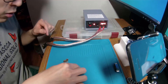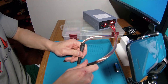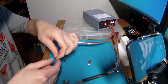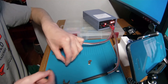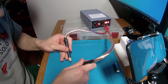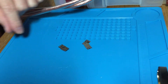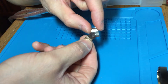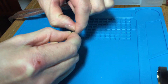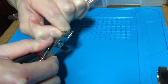So, nickel on nickel, starting at level 3. You can see it made marks in the back but didn't blow through anywhere. Let's see if we can break it by hand — no, I'm not going to be breaking it by hand. So it's a solid weld at level 3.